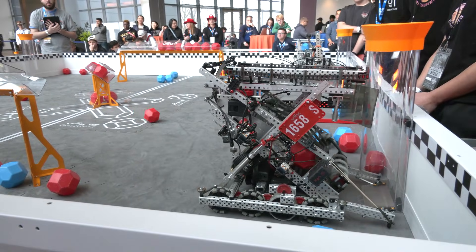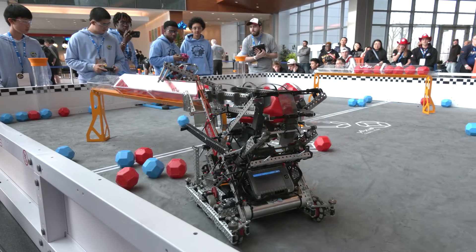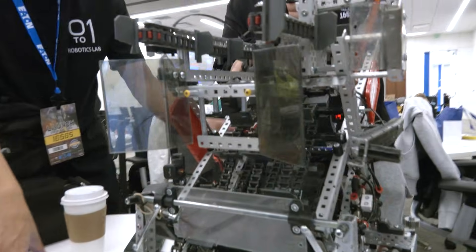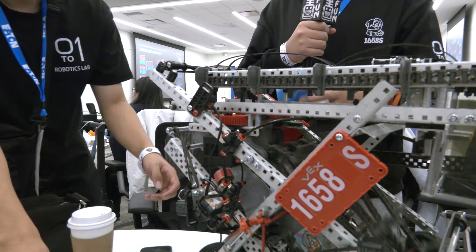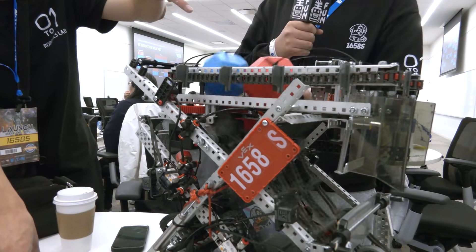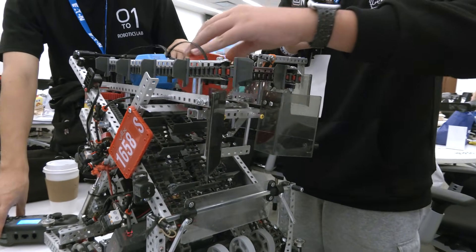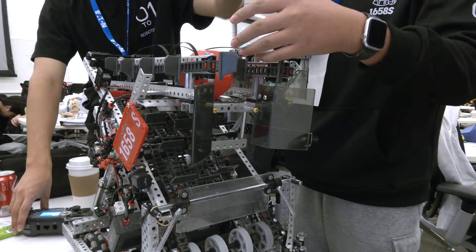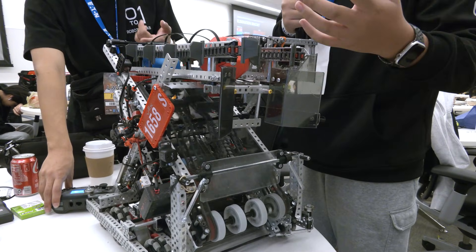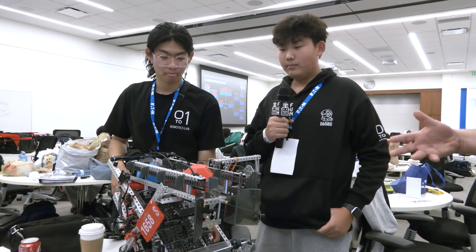Jasper, let's break down some of the sensors that go into this robot. What are some key ones that are really helping you win matches? So in the match for the driver, we only have two distance sensors — one here and one here. When blocks go up through the whole system, this one detects the blocks and makes the motor move 95 degrees forward. And when this sensor here detects blocks, which means the whole conveyor is full, it won't let it move anymore so we can store more balls under the conveyor. Coming up with indexing like that is so effective for what your team has been doing.